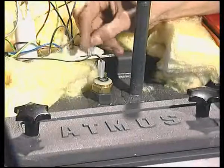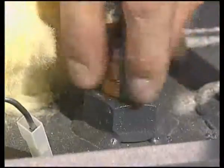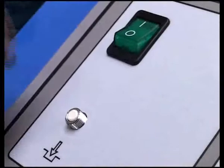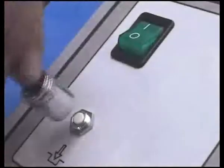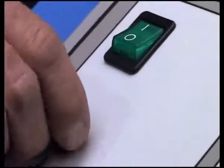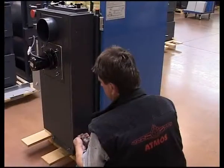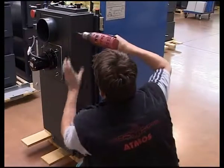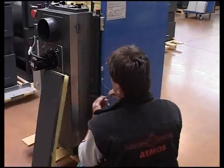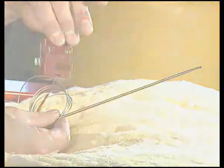If we are replacing the pump safety thermostat or the built-in thermostat, all that is required is to remove the connectors, unscrew it out of the base, and install a new one. If replacing a safety thermostat located on the boiler's control panel, proceed in a similar way as with the regulating thermostat. The flue gas thermostat that shuts down the ventilator after all the fuel is burnt is removed by first removing the side insulation of the flue gas pipe, then removing the thermostat capillary from the rear pipe, then removing the thermostat and installing a new one.